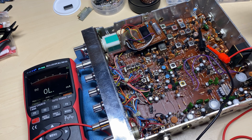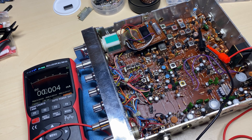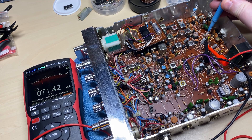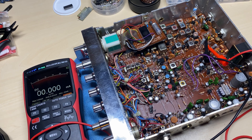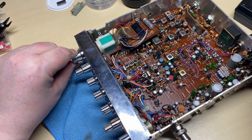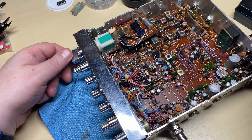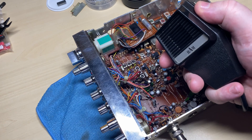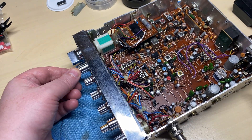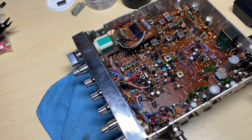We'll just have a look at the biases of the finals as per the service manual - about 50 milliamps across the test points on both. It's a very twitchy control but roughly in place, that'll do for now. We seem to be a lot better than before - it now sounds okay on receive, whereas before it didn't. What do you expect with 13 volts all over the place? Transmit is nice and clear and we're actually receiving something on triple five - excellent.